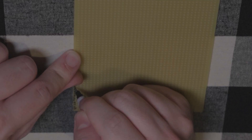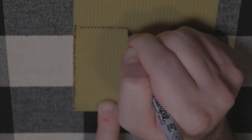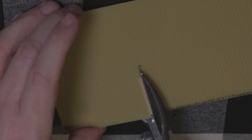We're going to start by preparing the copper strip board. Get your board and make sure the copper strips are oriented vertically, then flip it to the blank side where we'll make our marks with the Sharpie. Label the rows alphabetically down the left side — J should land at the bottom and A at the top left corner. Label the columns from 1 to 17 across the top row. I also put little lines where I intend to cut. We'll be cutting through the rows of holes rather than in between them. Take your tin shears and carefully slice along those lines, cutting the row above A and the column to the right of 17.